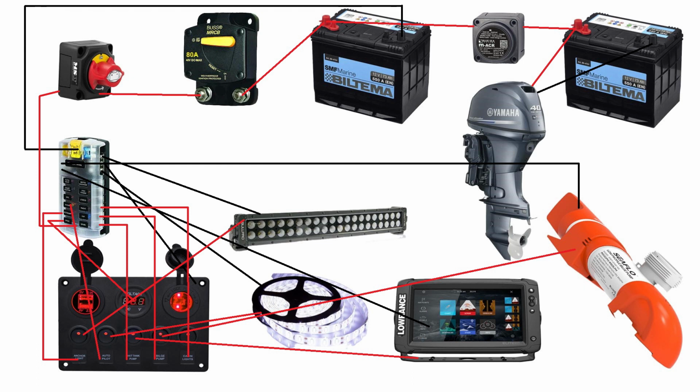And the use of the ACR is that it is checking the voltage of the starter battery, and when the starter battery is full or charging, then it is moving some of that voltage to the home battery, so that the home battery is getting charged as well. And if the voltage from the starter battery drops below a certain voltage, then the ACR will stop providing any electricity to the home battery. And this is simply what that device is doing.